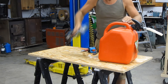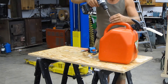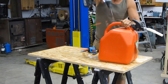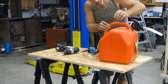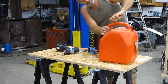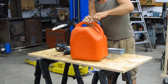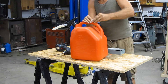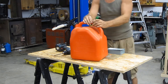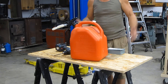The regular metal bit will dig in and pull the drill through. So we're going to put it right about here — when I'm pouring my hand is here and when I'm carrying my hand is here, so I'll put it right about there. That's a nice hole. I'm going to push that right in here — that's nice. I'm going to screw the cap on. That is awesome, and that's how you put a vent in a gas can — made out of nylon, which is impervious to gasoline.